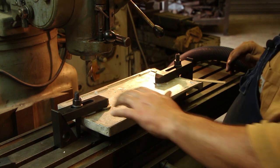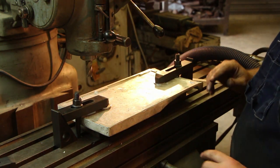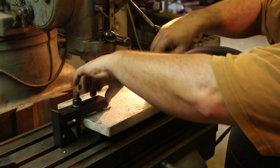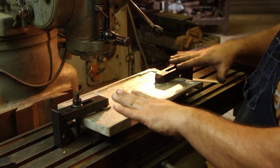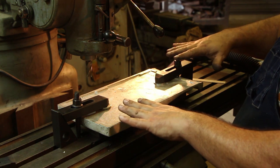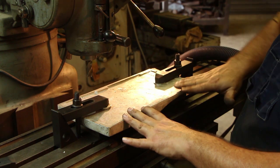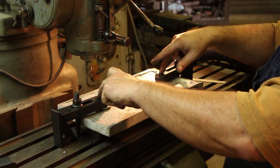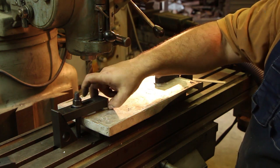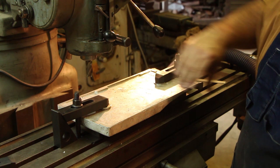And by using some spacers up underneath here and using some washers as additional spacers, I'm clamping really all my force just down in these two spots right now, which is where I was able to determine is a pretty good place that I could clamp this and keep this fairly level to start with. So I've really just got two places, and you can't see it, but there's washers up underneath this as well. All my clamping power is going right here.